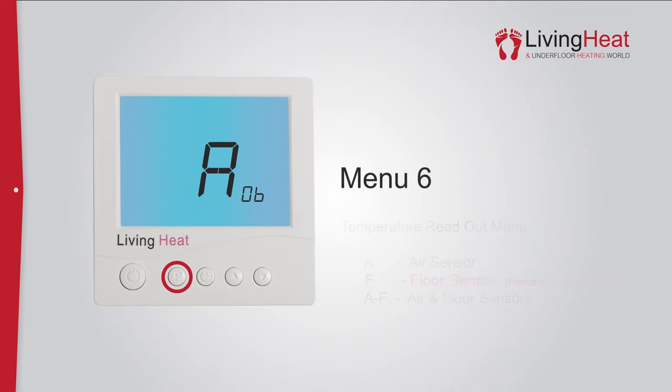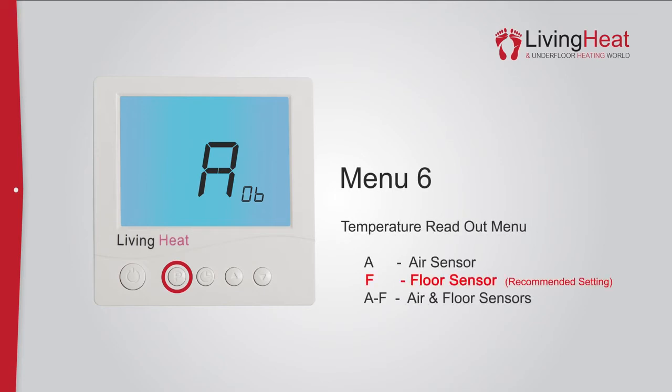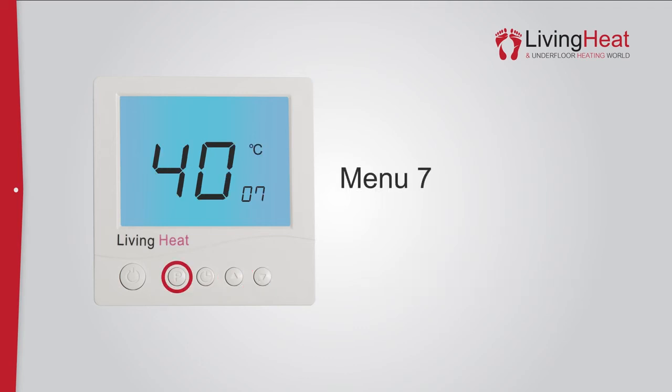Use the up and down arrows to select your desired setting and then press the P button to move on to menu 6. Menu 6 is the home screen temperature readout. This can be set to show A, air, floor, F, or a combination of both air and floor temperatures together with A and F. To save confusion, we would recommend setting menu 6 to the same as you have set menu 1. This means if you set menu 1 to F, i.e. to regulate floor temperature, then you should set menu 6 to F as well, i.e. to display floor temperature. Use the up and down arrows to select your desired settings, and then press the P button to move on to menu 7.